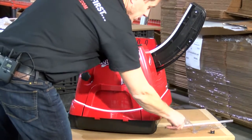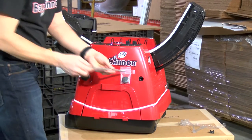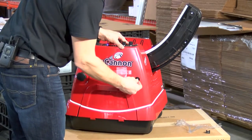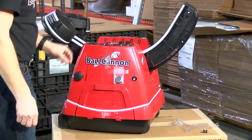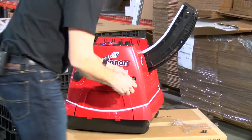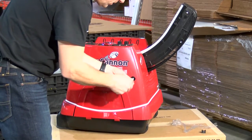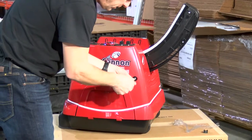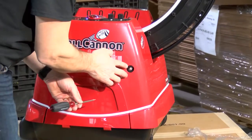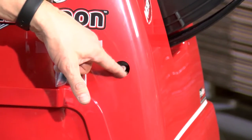Next, we'll grab the rear shaft and do the same thing. Threaded side goes in first, the end with a slot on the outside. Push it. You'll feel a little resistance also. Just give it a little bit more of a push. And those are inserted. We'll grab our slotted screwdriver and turn this shaft until it's beneath the outer surface of the outer enclosure, and I put it in until it's flush with this inner black assembly beneath the enclosure.